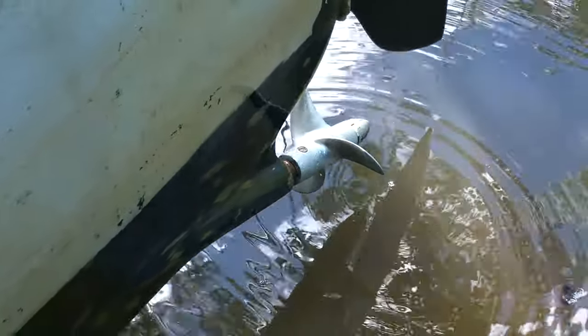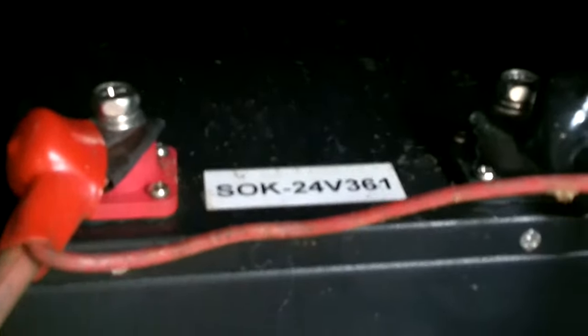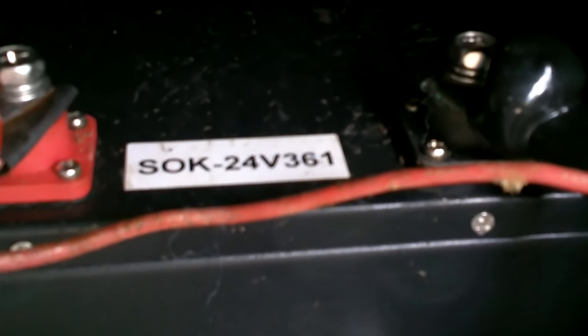Good job, Propeller. I'm really happy with that — like really happy. I want to do a bit of quick math. In here I've got this nice fancy battery, an SOK 24V 100Ah lithium battery. I'm super happy with it — it's been really, really good. At 100Ah, that means I can go about 3 hours at full speed, roughly, if it's drawing around 35 amps — just under 3 hours. But if there's also a bit of sun helping, I can get that down to 32 amps — 3 hours and a little bit. It's like an hour and a half trip to town, at least that's my estimate — I think it's actually less than that at full speed. So if I can do that trip in an hour and a half, that means I can get all the way there and back on one battery charge, which I don't plan to ever do because I don't want to run the battery down that much. But that's good to know.